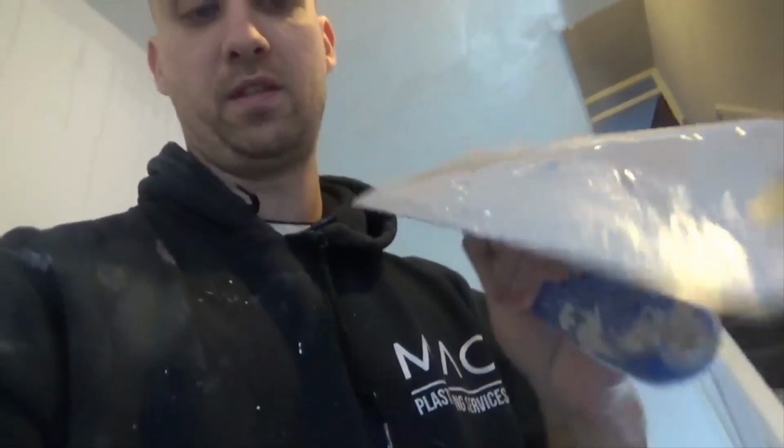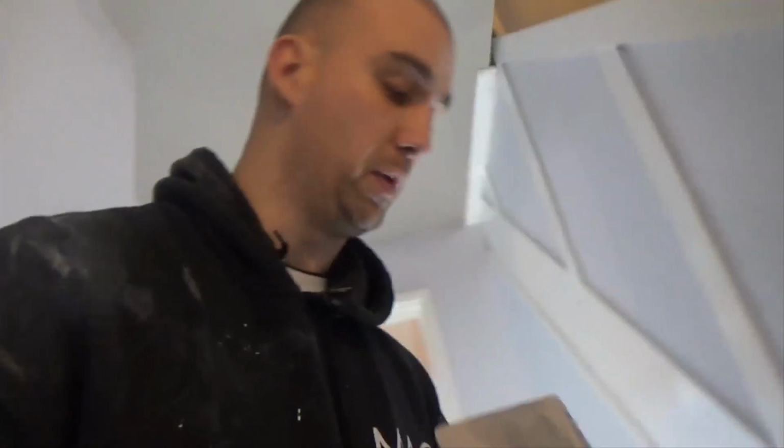But I just wanted to give you this other wee tip here. After you use the trowel, you will have just a tiny bit of fat. You shouldn't be wanting to absolutely rip the life out of the seam, and basically you're going to have to clean this off before it gets hard, and you'll always want to trowel that off the seam as well, guys. You can still use this to fill in and stuff, but I'm going to show you a wee trick. So basically down with the water bucket here.